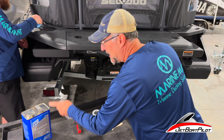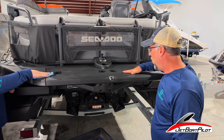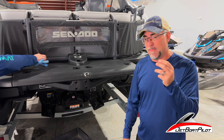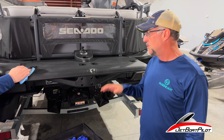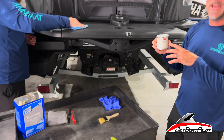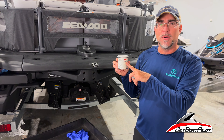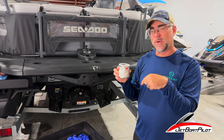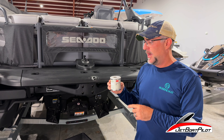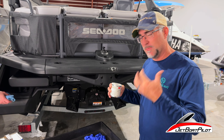We're going to have some rags and acetone. Acetone is important for wiping down the surface and getting any oils off — a brand new boat coming out of the factory is going to have a mold release compound, so getting those sorts of things off the boat. So we're just prepping the boat with the acetone and the rags. Although not included with the kit and not mandatory, if you want the absolute best stick, we recommend a 3M primer called Primer 94. We'll put a link in the description below — you can find this on our website or also on Amazon. This is going to give you a much greater bond strength for your pads if you really want them super stuck.